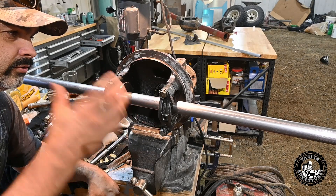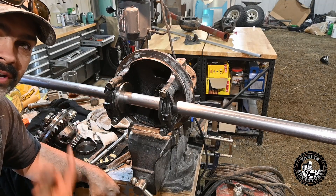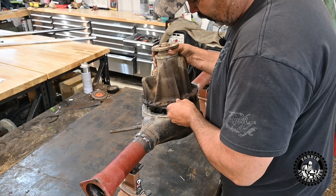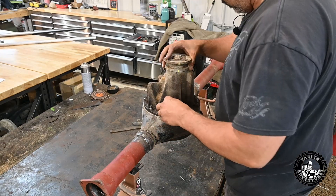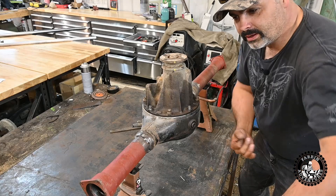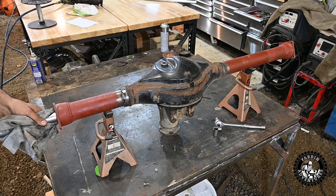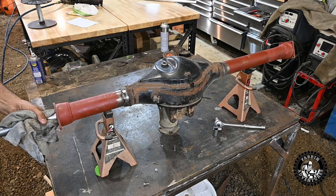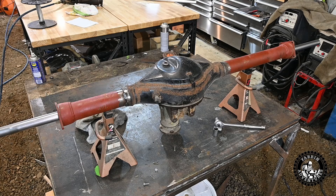No play. So now we'll be able to drop this into the housing, run our shaft in, and then we should be able to check for straightness. Now we're just going to torque these down to where they need to be and then we can run our shaft through. There she goes — slide her all the way through and we're ready to slide our wheel bearing caps in.